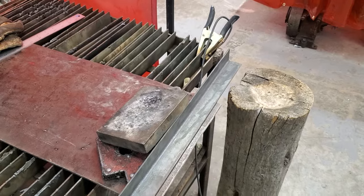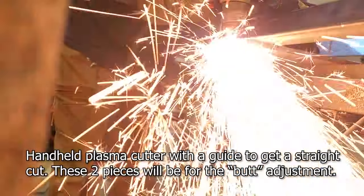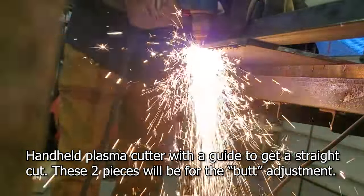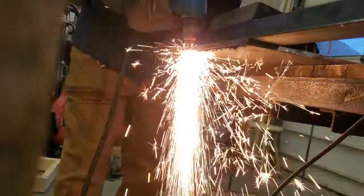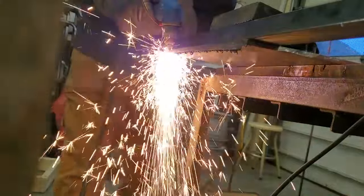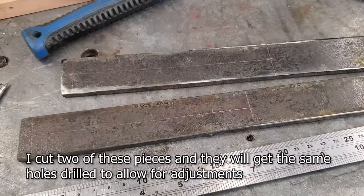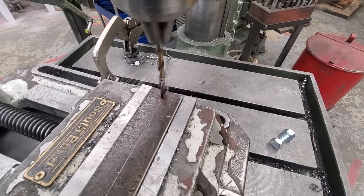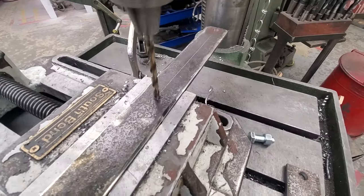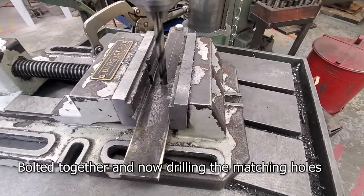I need some way to adjust what I call the butt part of this project. I'm going to be cutting out two long rectangle pieces using a handheld plasma cutter because I like this thick material — it would not fit in a bandsaw and takes way too long with a zip disk on a grinder. This ends up being a mostly rough cut and then I grind it down to shape to get them to match perfectly. There's going to be a series of holes drilled in this so that a pin can hold the seat at angles from zero or flat up to about 20 degrees. Don't quote me on those numbers — I really eyeballed most of this. All 3/8 holes again.